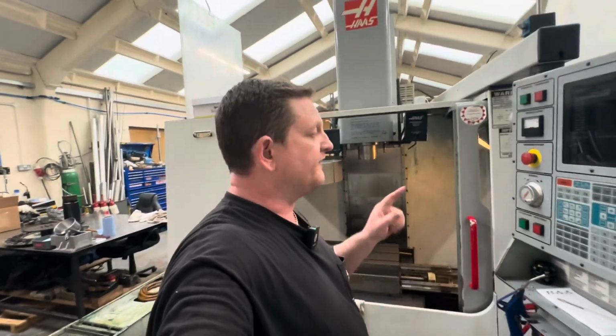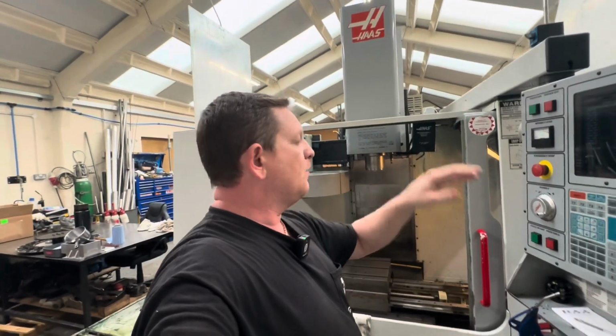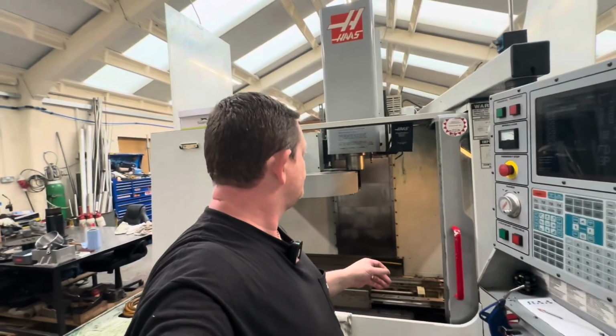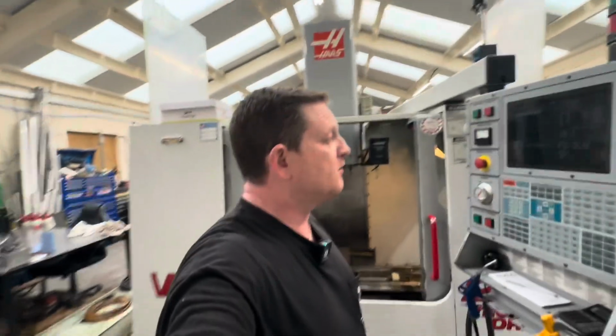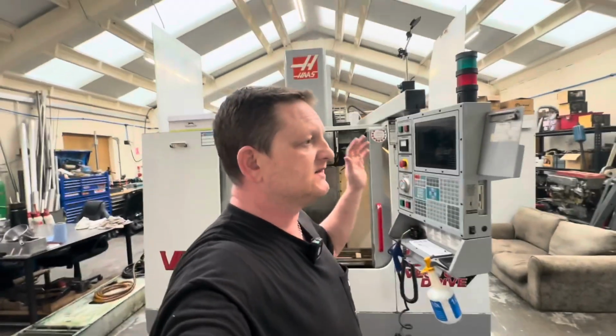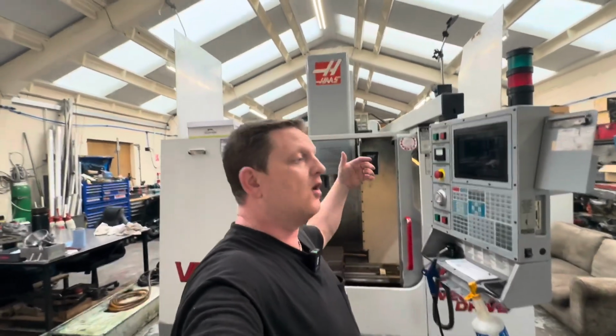So far I've also found if I push the E-stop in and the X phasing error is not there, when I do the home in, you don't get the servo error too large. So you can see everything else is running beautifully. So yes, E-stop in, error disappears, doesn't even occur. E-stop out, error's there every time. Does that mean anything? I don't know.